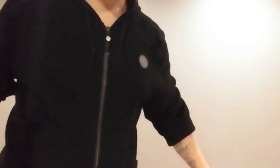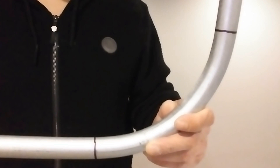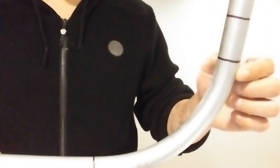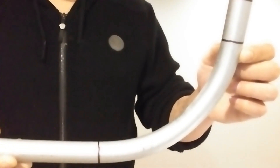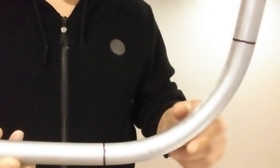The reason for that is with the bends we're going to be doing, we're going to be using the front of the hook. Get the measurement from the front of the hook to where it starts to bend, store that measurement, and I'll show you why you need that later on.